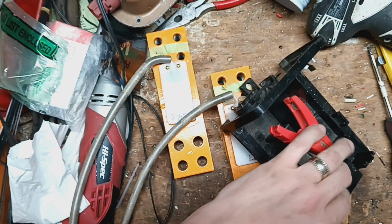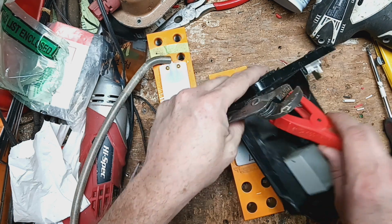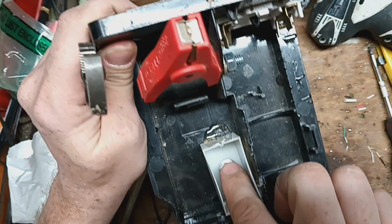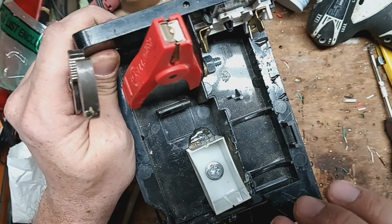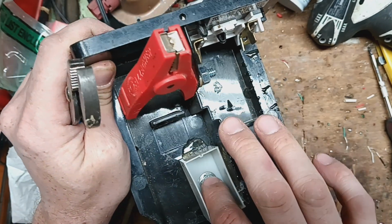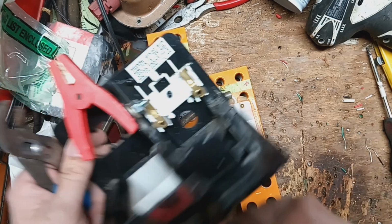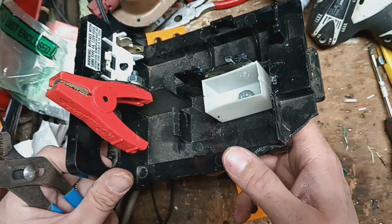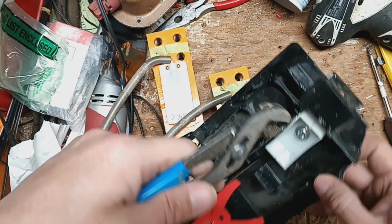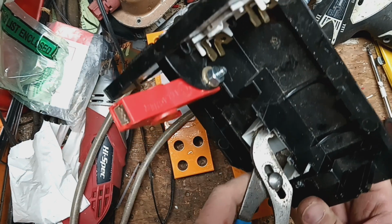And I usually do it as tight as I can, because I've seen other people do the same repair and they didn't tighten this thing down far enough. And it started to epoxy up real good. And you think the epoxy would hold that bolt still, but then they go put the bolt and everything back into the low bar. They're tightening it up. As they're tightening this up, the bolt starts spinning inside the epoxy, and then like, oh shit, now what do we do? So I guess I learned by mistakes over the years of what to do, how to do it.